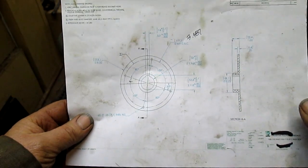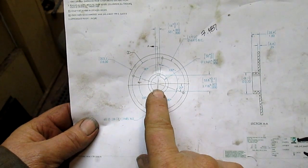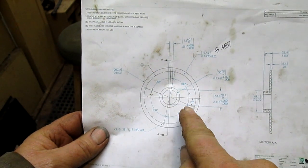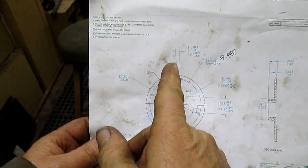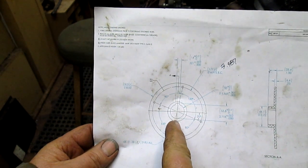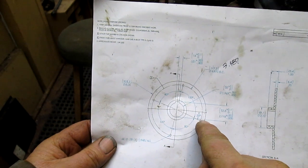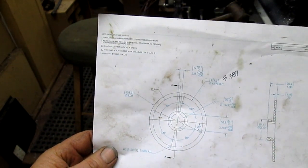Okay, I'm not sure if you can see it or not, but we have a key here, and all of my drilled holes are in line with that key. So I have to set up the key at a 0, and then come across, actually I start at 90 and then come across 20 degrees and come across 80 degrees and 100 degrees and 80 degrees and 100 degrees.